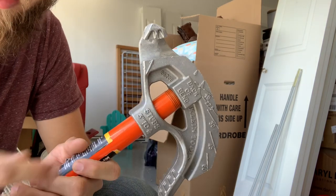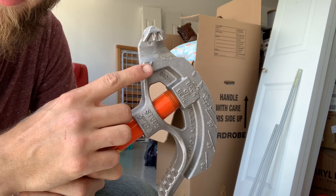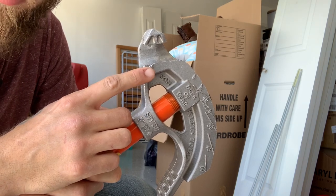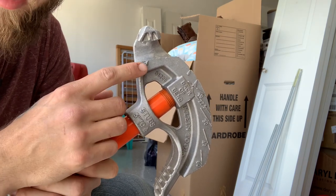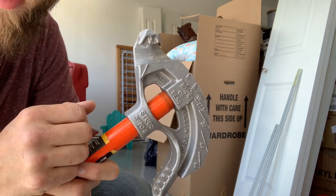All right, so here's our half inch bender, half inch EMT. You'll see our marks can go right here on this arrow. So we'll put our first mark there, bend to 30 degrees. And we'll do a 180 turn with the conduit to the next mark and bend 30 degrees the other way. And that'll be our offset.